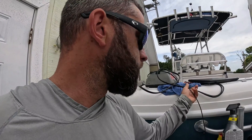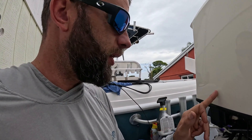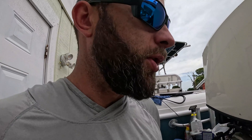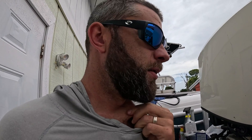If you don't program these injectors they're not going to work and you're going to cause a lot of issues. You also need a cable — I have it hooked up to the communication port on the engine. It's an adapter that comes with the software; it hooks into the communication port on your engine and goes to the USB port on your laptop. That allows you to look at everything on your engine: diagnostics, hours, fault codes, program engine settings, oil settings, software updates, and more.